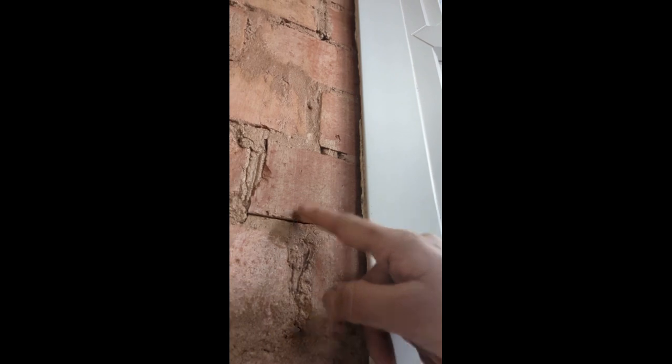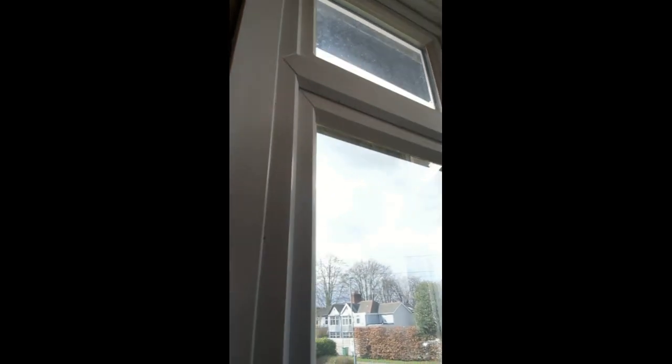In addition to the work on filling the mortar, in readiness for sticking the plasterboards and insulation boards on, I've coated it with a clear coat of PVA — four coats, which is possibly a bit excessive. The first coat was really watered down, the second coat had slightly more PVA, and I ended up with a final coat of half and half — 50% PVA and 50% water — which has given it a nice clean finish for me to start working on.